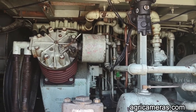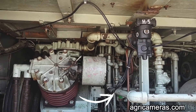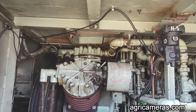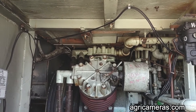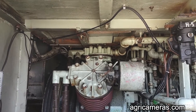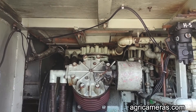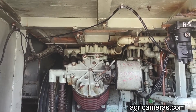In the access area below the cab, the four cables are zip-tied to any members that are not high temperature and not high vibration, and from there fished into the two engine compartments — one in the front and one in the rear of this center cab locomotive.